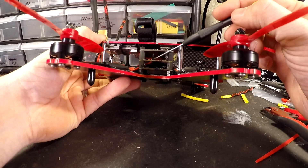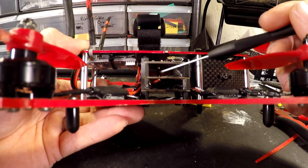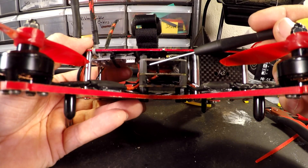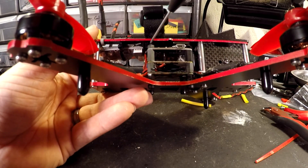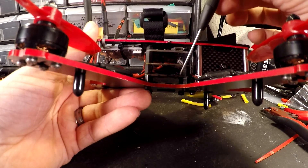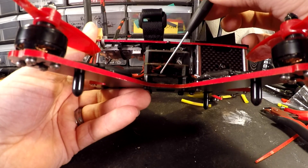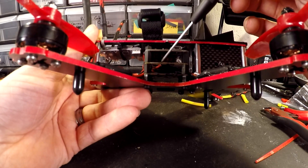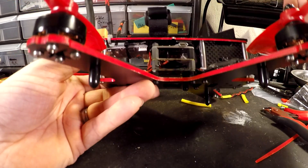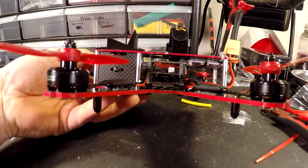The one difference with the OS Doge and the Naze is that there are three connections that piggyback on each other. You have your TX and RX — it's just a little male and female connector that plugs straight together. There's another one feeding 5-volt power to the Naze up at the front. Then there's the battery sensor in the back. My power distribution board is a Brotronics Uber Distro — it has current sensing and I believe a voltage sensor as well. I have a short wire going from the current sensor straight up to my OSD, and that's the only other wire plugged into there.